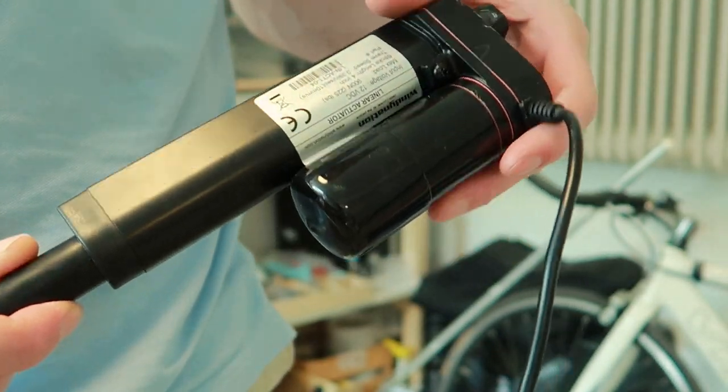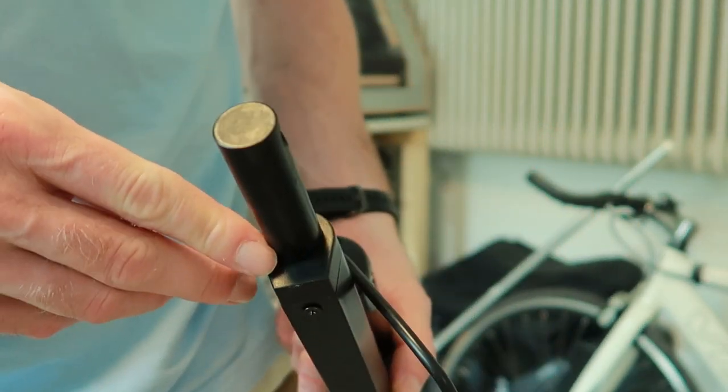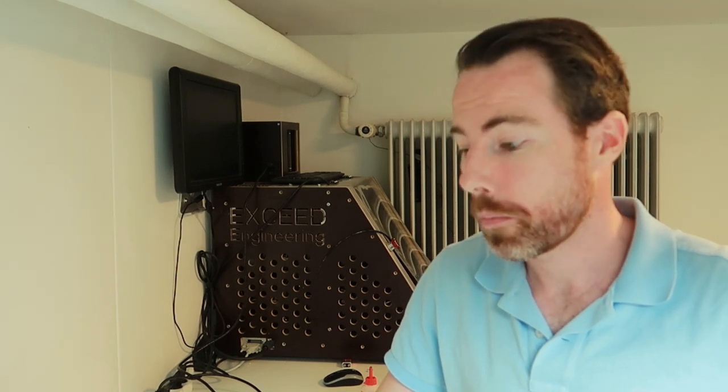So I'm basically going to make a pole with some kind of tilting mechanism up there. And instead of having that tilting mechanism driven by gravity and a gimbal, I am instead going to use this linear actuator and a switch on my helm. That means when we are heeling over to one side or the other, I can simply manually adjust the radar to be fairly level to the horizon and give me the best radar picture. It's going to be extremely fun to do. There's going to be a lot of parts, so let's get to it. Let me just go up and make some quick CAD drawings. And after I've made that design, I'm going to head over to my trusty homemade 3-axis CNC machine here, and then we're going to make some chips.